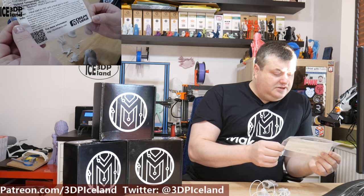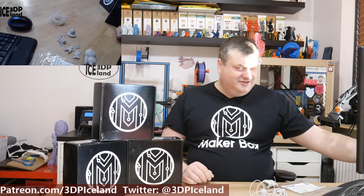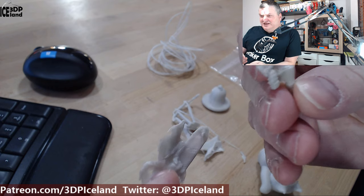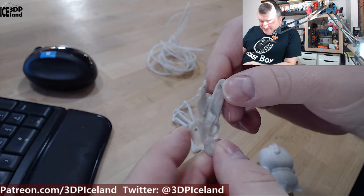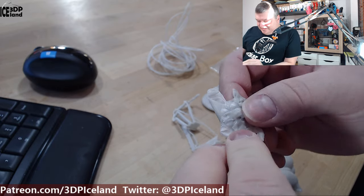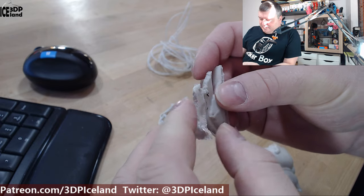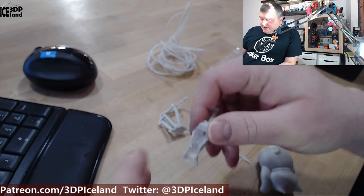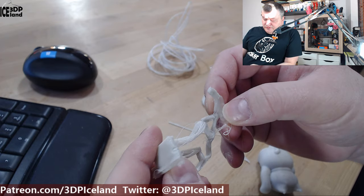You can have a look at this filament at formfutura.com. But I did some printing — or attempted some printing — and found it to be quite strange. A few of the models I tried ended up as blobs, like this one. This was a Mr. Belly Foot, and this was my MakerCoin, and it was not giving me excellent results as you can see. Here's another attempt with the MakerCoin. The problem I was having was with the bed temperature at 60°C — the base was melting. Here's a bridging test gone wrong; I cancelled this print while trying to remove it from the bed.